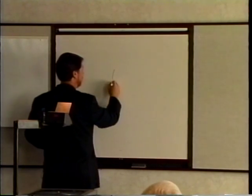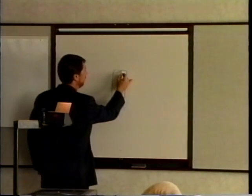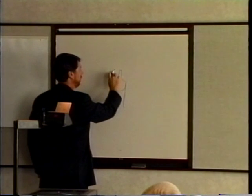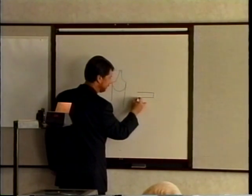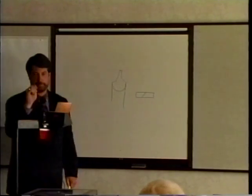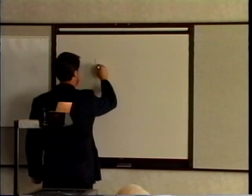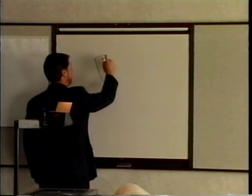So you have your screwdriver blade, if we're looking at it sideways, something like that. If you take and grind that down like that, and then of course after these are removed, you want to put your edges on so when you look at it from the top, it looks like a drill bit. And then this, being very small and super sharp, being made out of carbide, you can remove the weight from the underneath of your solid rim balance wheel that way, and it does a real nice job. Something like that, and of course, in real life, they've got a slight taper on them up there.